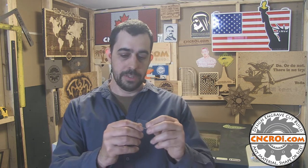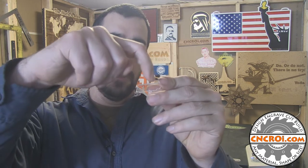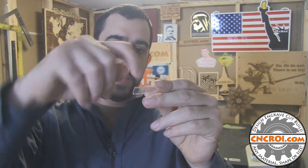I have to be very careful because it is very thin plastic. It is bulletproof glass, but it's still plastic, and if I push a little bit too much these things go right out of spec. The nice thing about tabs is that they're so thin that when you push it into the sand belt, it right away takes off the tab. And as soon as you feel a little bit of pressure, you know that you're sanding exactly what you don't want to be sanding and the tab is gone.